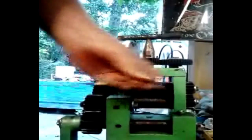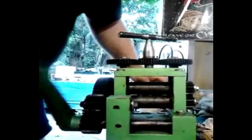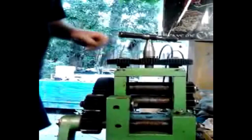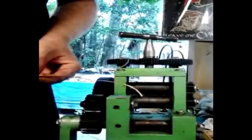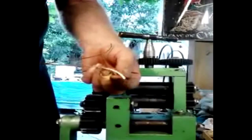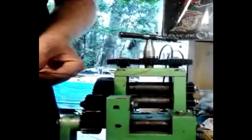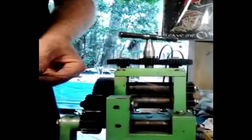I'm going to show you a trick how you can get some thinner solder out of this. What you do is bring it over to your rolling mill and get it set fairly tight, but not too tight. Now you've got two thinner pieces of solder, and this also makes a nice handle so you can get just a small amount of hard solder and adjust it to the right place you need it.